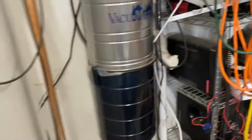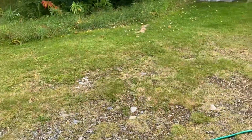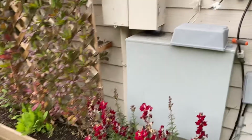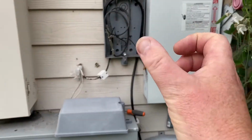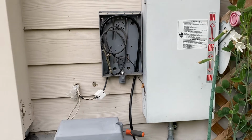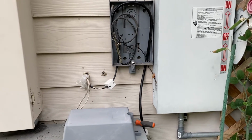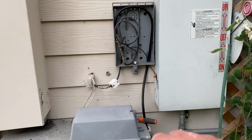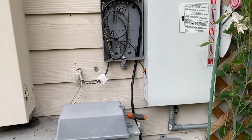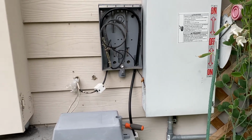So anyway, just think sometimes about what you've got in your house. You've got your normal switch mode power supplies, which you can choke off, those cheap horrible plug-in ones with no filtering. I tend to use the Apple little round white block ones, or the bigger ones. They seem to have very good screening. But if you have a noise problem at HF, or in this case MF, think about what may be attached to your earth system here, or on your system coming in, especially if you're using cable or DSL or something like that. We used to have DSL here, but it was just awful noise-wise, so we got rid of that.